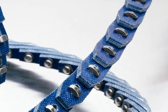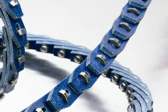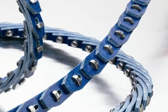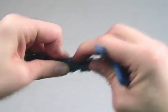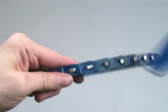Super T-Link SP Wedge Belts are for drives using metric wedge SP rated belts and are available in standard SP wedge sections. Like New T-Link, they are connected with metal rivets that are easily assembled and disassembled with the provided tool.